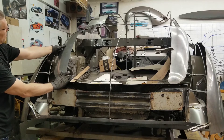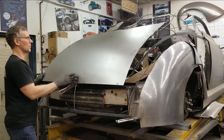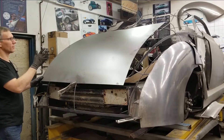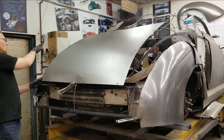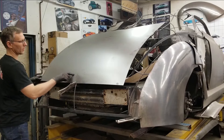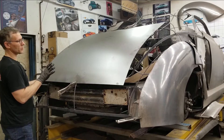Can we call this done? I don't think so — we have a long way to go. I just wanted to show you what we're starting with. Took this four-by-eight sheet, cut it in half, laid it up here, clamped it, and what we do is scribe to the buck where the other pieces kind of ended, give ourselves some overlap, then trim up what we don't need, and then we can start working this panel in. There's a main radius through here — you saw me working on that on the side pieces — and that's going to have to blend into those side pieces.